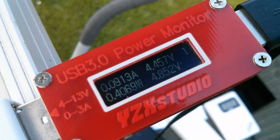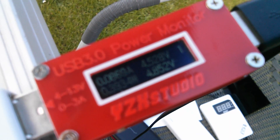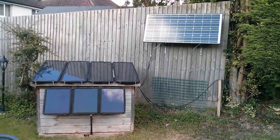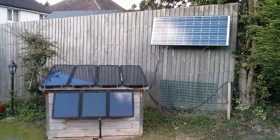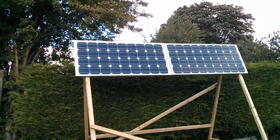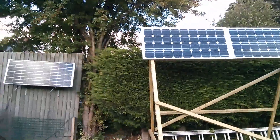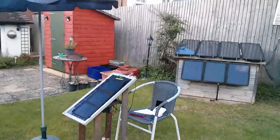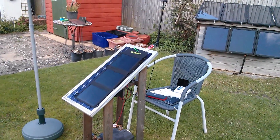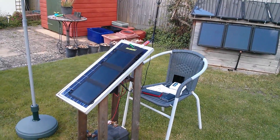The sun's gone behind a cloud and we're down to just half a watt. If you plugged this thing in and got half a watt having read that it should be capable of 16 watts, you'd be quite disappointed. But I've lived with all my solar panels — the amorphous ones, the monocrystalline, and the others — for several years. I know what they're capable of in full strength sun and how much less you get when the sun goes behind a cloud.